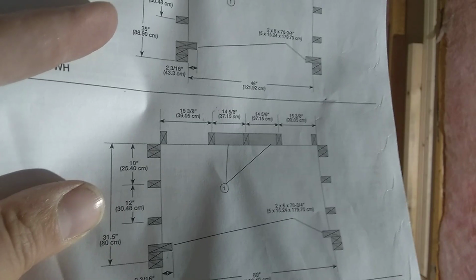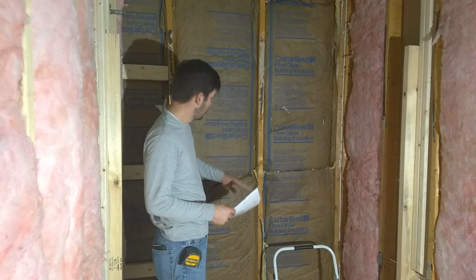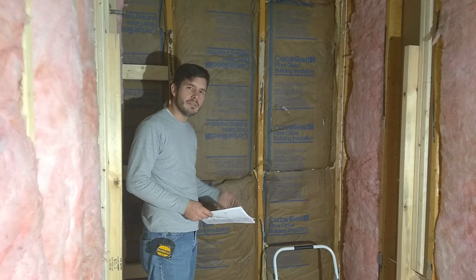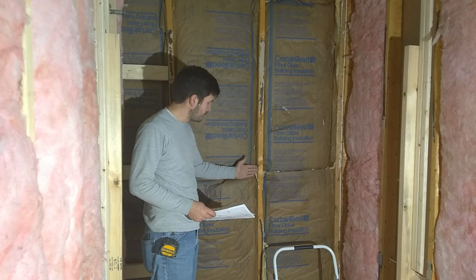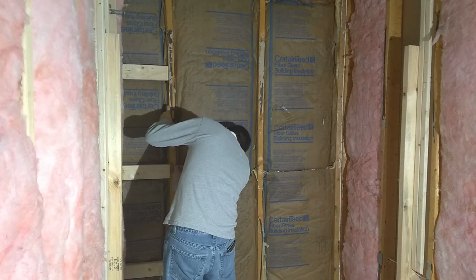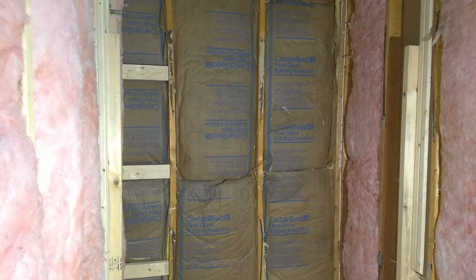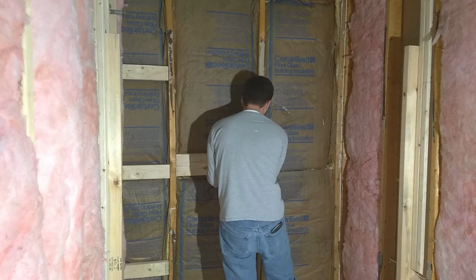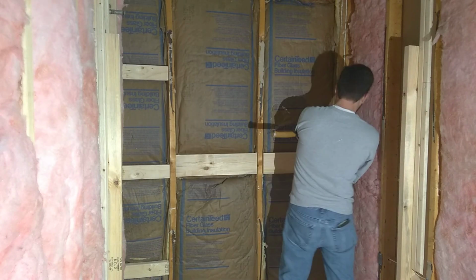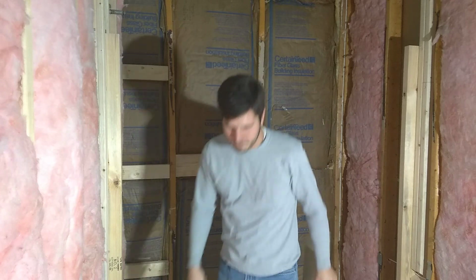Looks pretty decent. So the last little portion of it that I need to do is these 2 blocks in the bays. This says 50 inches up. So instead of doing a stud that's proud, I'm going to do a stud that's flat here. And that'll essentially give the same end result as what they're asking for. And I'll do one here and one here. I'm just going to try cutting 2 at 22. I just got to cut it shorter. It just won't fit.